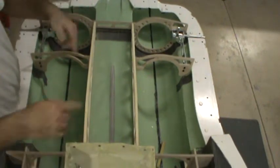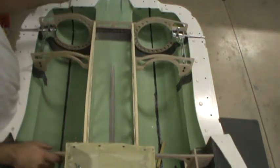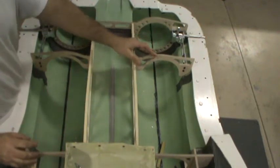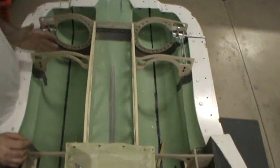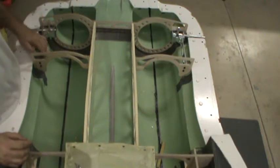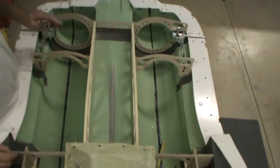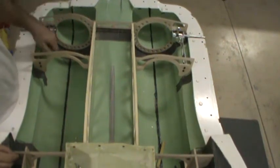All the side-to-side bulkheads are this finished birch aircraft ply. There are four full-width ones in there. There are two quarter bulkheads that basically just help support the front of the servo and pivot snap mechanism. I've got a couple bolts here temporarily for now. I'm waiting on two more servos to get here for the horizontal stabs. I'm actually going to set the servo linkages for these with the back boxes and everything before I close the fuselage, just because it's going to be easier.